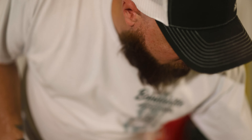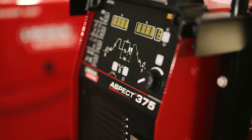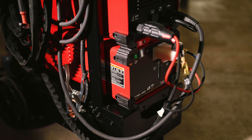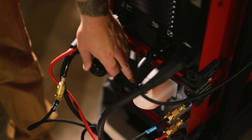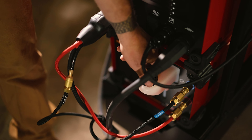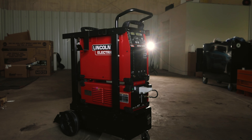After that you're probably going to be a little bit low. Lincoln recommends a little over a gallon and a half, so fill one bottle up, trash it, get the next one and start filling it up. What I like to do is leave the cap off, compress the trigger or use the foot pedal — the machine is on and it's circulating — getting all the air out of the system. Lincoln says to crack the cap about a quarter turn so you can get all that air out. Check your levels, and once you're nice and primed you're ready to go.